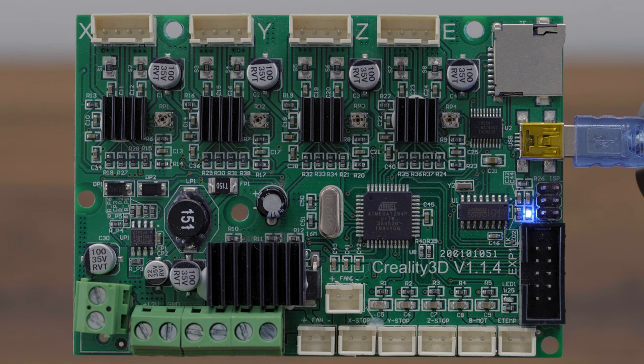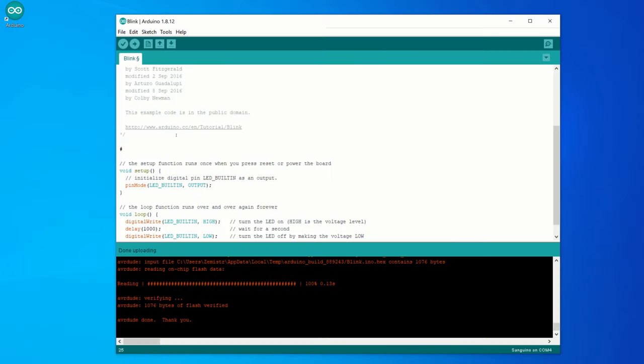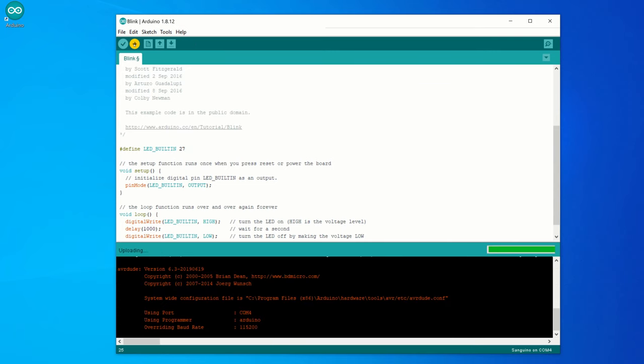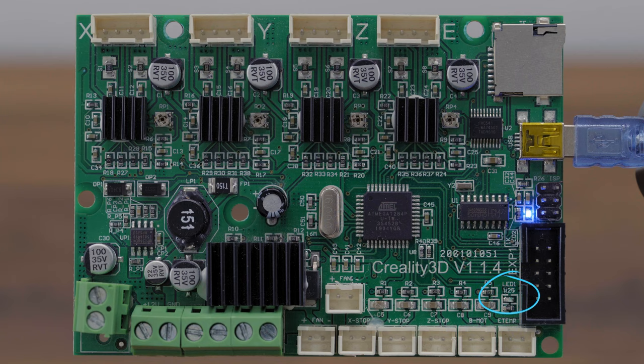I already know that this motherboard has no built-in LED, so after uploading you will see nothing. But this board also contains an LED marked as LED1 connected to pin 27. Again, we just have to add a definition for the constant LED_BUILTIN with a value of 27. After that, we can click on the Verify button and if the verification is without error, we can click on the Upload button. Now the LED should blink exactly as we wanted.